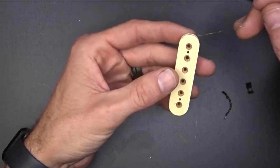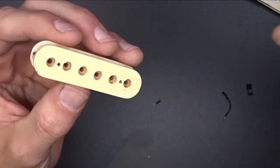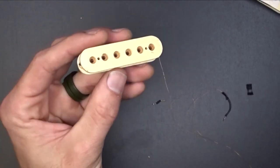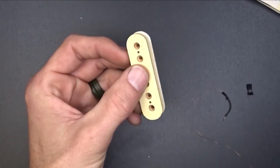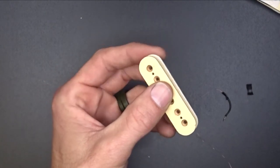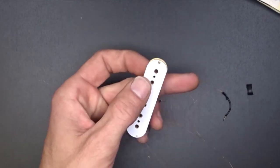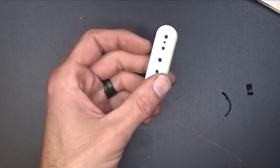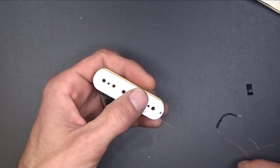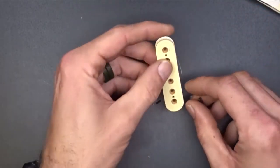This one is wound clockwise because our windings are coming off counterclockwise. So when they spun this guy, they spun it this way, but it's winding it clockwise. Can you see that? You see what I'm saying? They spun it backwards. Now if you spin it from the backside, they spin it clockwise and it's winding clockwise. Does that make sense? That can get kind of confusing sometimes, I know. So we're going to go back with a clockwise winding on it.